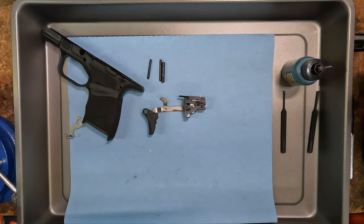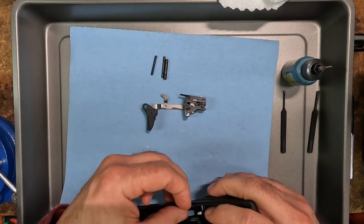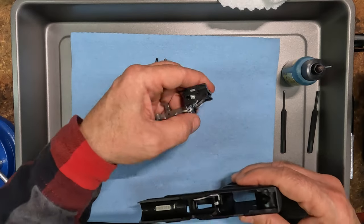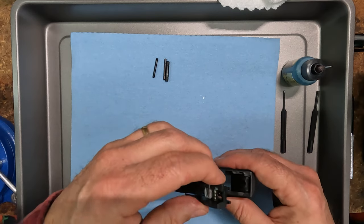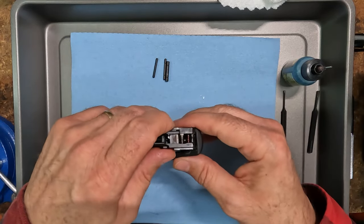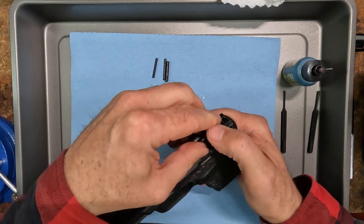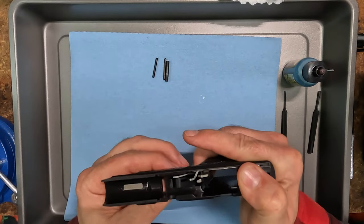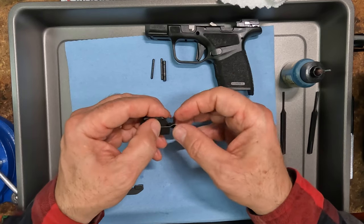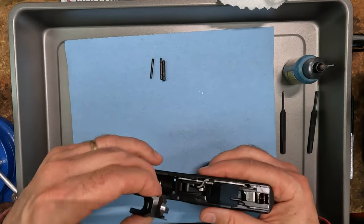When it's in there, make sure the spring is sitting in that little groove — you heard it click, it needs to be right in that little groove. Put just a little dab of grease where that retaining spring goes, grab that little spring and slip her back into that little notch. That has to be there or bad things can happen as you're clicking and banging along. The mag blocker sits in this little groove and she's gonna ride back and forth in there.